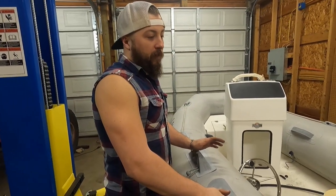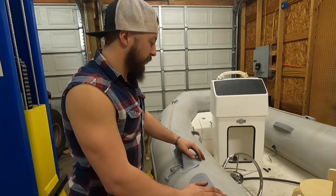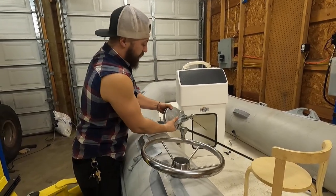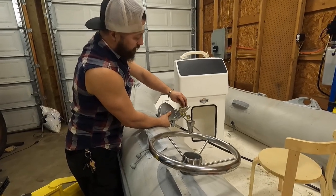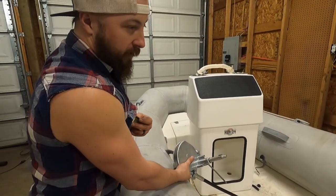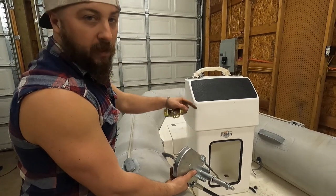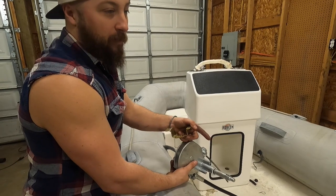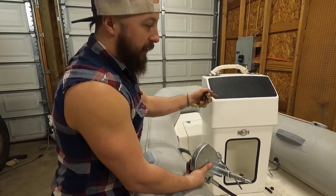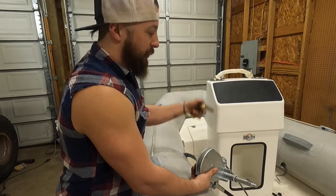The next thing is mounting. This uses three bolts and a mounting plate, so I'll be drilling a hole and mounting after I mount this. The biggest thing you don't want to do is bend the cable as much as possible — every time you bend it, you add resistance to your steering. So I'm going to mock it up and then scoot the center console back and forth until I get ideal angles on my cables for smoother steering, then I'll mount it to the floor.